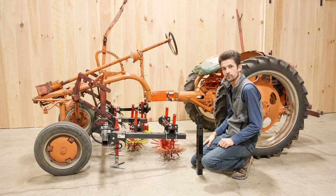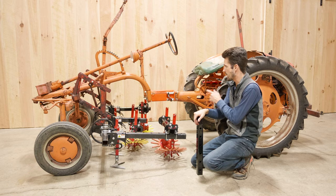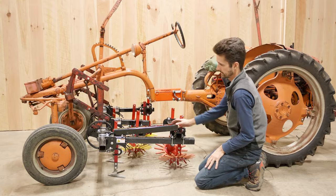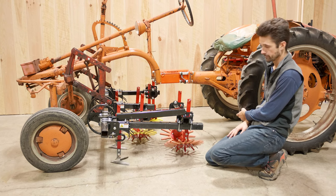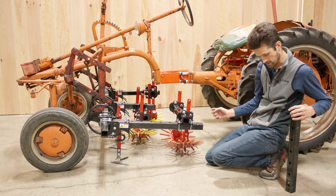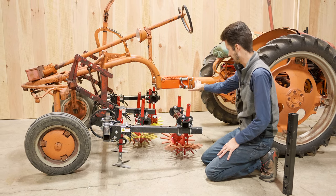Alright, I'm back — we got the extension installed with a little persuasion. We flipped the tractor to give better visibility. Let me show you why the extension makes it work. Only one change was made aside from adding the extension: we changed the length of the mod bar to this longer one. We couldn't do it before because it would hit the wheel, and our main problem was hitting underneath the pedal. Changing the mod bar length and adding the extension gave us a lot of room to bring these fingers off the middle row.